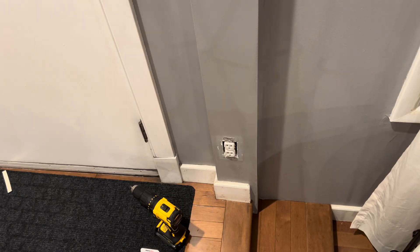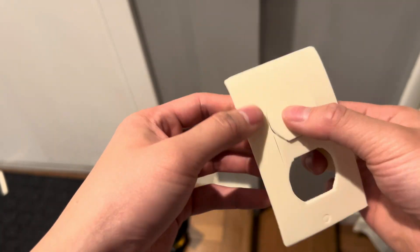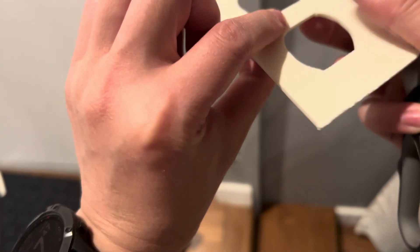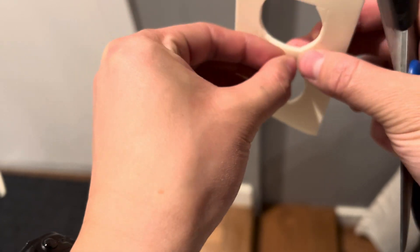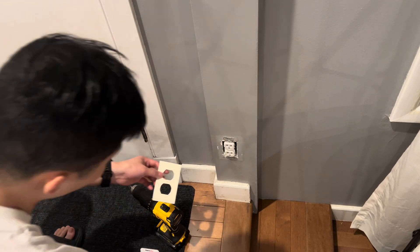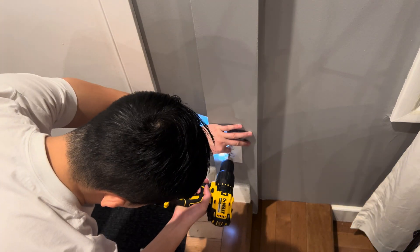Next I'll install a cover on an outlet. Given that there's only one outlet here it was a much quicker installation. The sleeves come in standard sizes so I didn't have to cut the sleeve on this one. Installing this insulating sleeve made a night and day difference — you can actually feel the cold air coming into the outlet with your fingers just before installing the face plate.